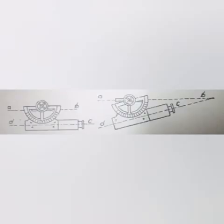In measuring a vertical angle, the observer directs the instrument towards the object and bisects it with the crosswire, and at the same time turns the milled wheel until the crosswire bisects the reflection of the bubble as seen in the mirror. He then reads the required angle on the arc by means of the vernier. It may be noted that the bubble tube is always horizontal and the vernier arm vertical, whatever may be the inclination of the telescope.